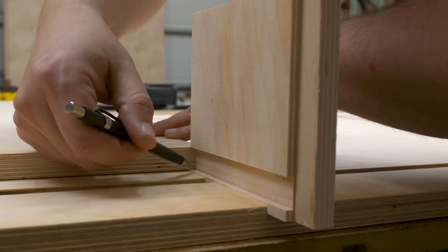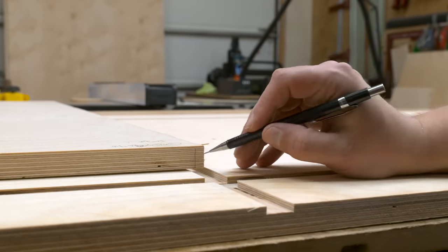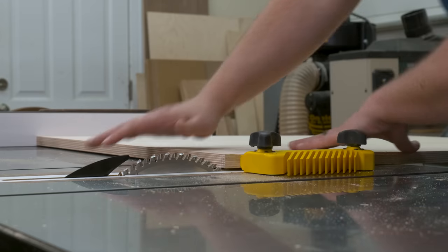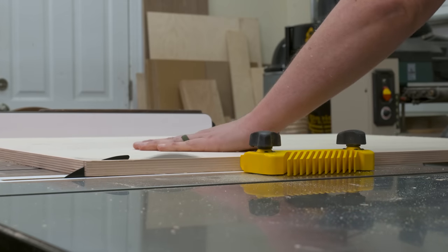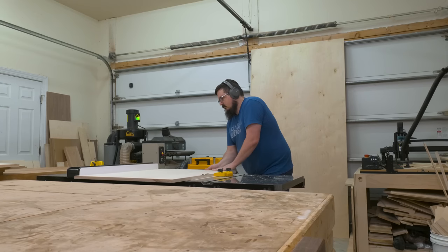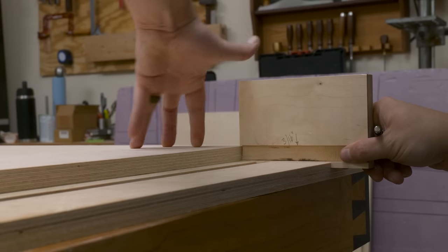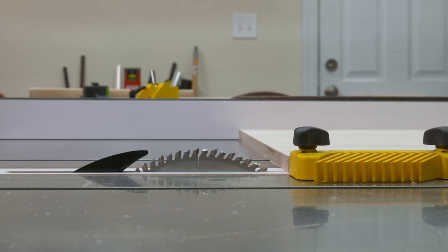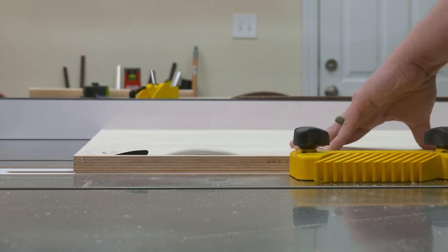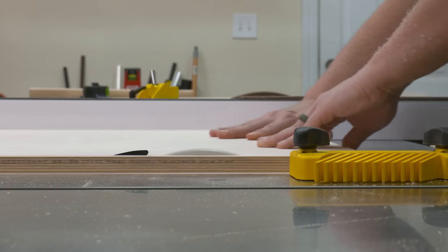While I'm talking about all these details, let me know down in the comments if you guys want plans for this project — if there's enough interest, I'll post them in the description and update you with a community post. With the width all marked out, I can take the piece back over to my table saw and cut it to its final width. On two of the shelves the width is going to be exactly the same since they have the same depth of dados, but on the right shelf that's not the case, so I have to take that measurement two times. The cool thing about doing it this way is you don't have to work off of any single measurement — all I'm doing is aligning that mark to the edge of my saw blade and making the cut. This takes a lot of guesswork and mistakes out of the cut and creates a perfectly spaced shelf without any real measuring, which is a win.